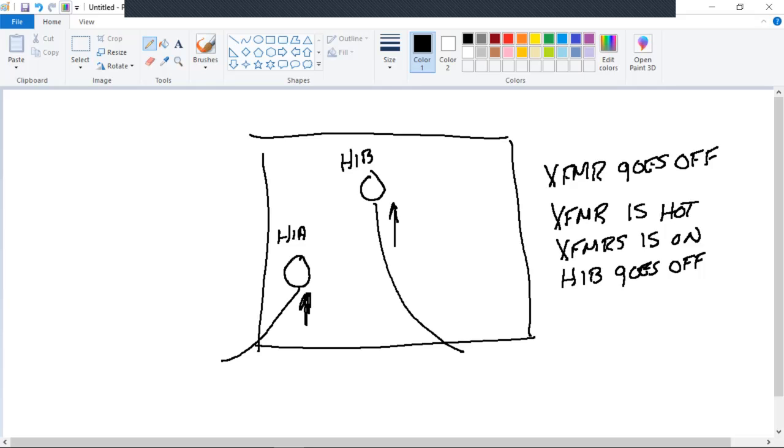You have to remember in this situation, especially when you start moving conductors and get into the three-phase situation, this is vitally important. If I pull off H1A and stand it off here, is H1B now de-energized? Yes. I don't mean for you to get really liberal with it and sling it all over the place. But now if I need to do anything with H1B, like training it around the transformer or moving it to a feed through, I'm working with a de-energized cable, and it's a lot safer. It's not grounded yet, but it is safer in that situation.